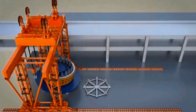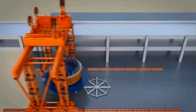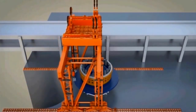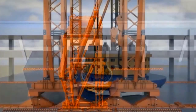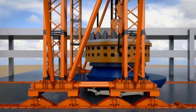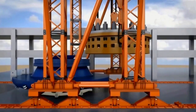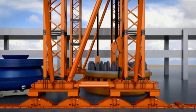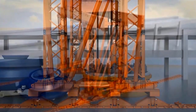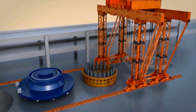That whole component of the TBM will be approximately 30 feet high, or half as tall as the viaduct — a very large piece of equipment sitting on the surface. At that point, we will begin the disassembly process, which involves taking apart the cutter head and the cutter drive unit that sits immediately behind it to expose other components that need to be repaired or replaced.